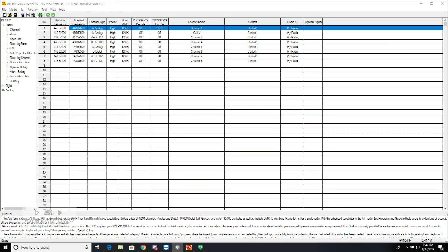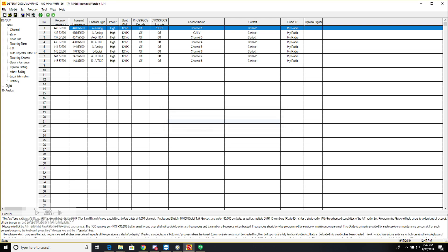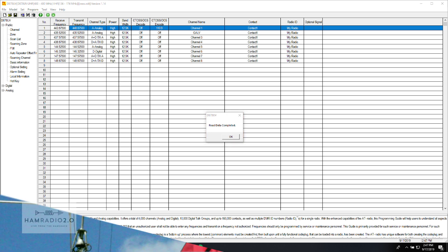The first thing you're going to want to do is read your code plug from the radio. It's a good idea to go ahead and read the code plug so that you have a latest copy of it. However, you should always have a backup of your code plug — your live code plug should never be only in your radio. It should be sitting on your hard drive. I have mine backed up to a cloud drive. Every time I make a change to a code plug, I put today's date on it. I've got a list of code plugs on my hard drive which backs up to my Google Drive so I can access it from any computer or my phone. So your most up-to-date code plug should also be on your hard drive. Bear that in mind for any type of update — that way if you screw something up, you can always go back and find a previous version.